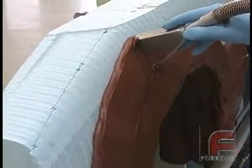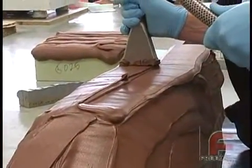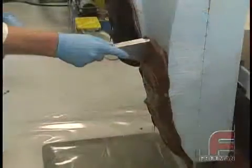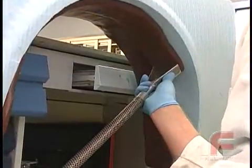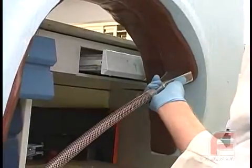Not only is this a cost effective way to retool an existing Renshape pattern, it is also used to create a three-quarter to one and a half inch thick seamless surface over an undersized substructure made from a less expensive material such as urethane foam board. Seamless modeling paste can be applied to vertical surfaces and even upside down, allowing you to build a seamless tool in sizes impossible or impractical with regular tooling boards.